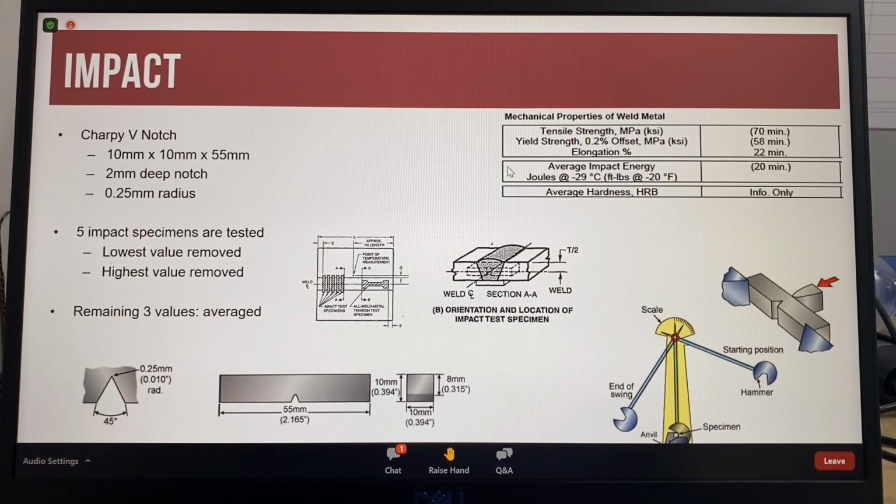An impact test is also a destructive test, but is different from a tensile test. A tensile test measures the toughness of a test piece under slow loading conditions. An impact test is focused on notch toughness and is a measure of a metal's resistance to brittle or fast fracture in the presence of a flaw or notch and fast loading conditions.